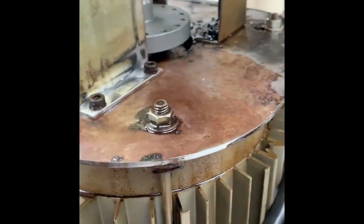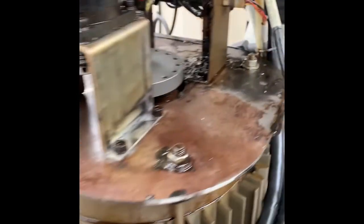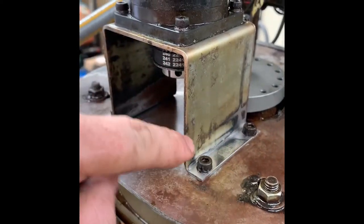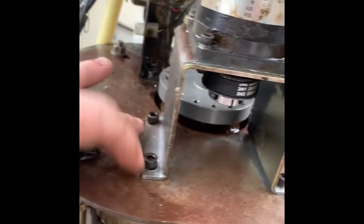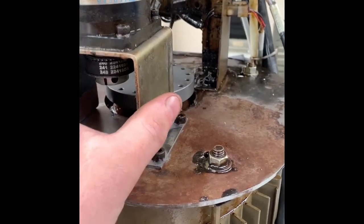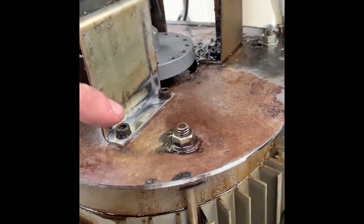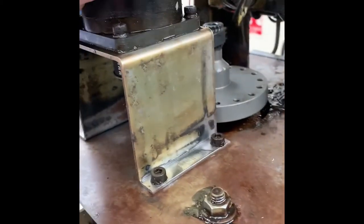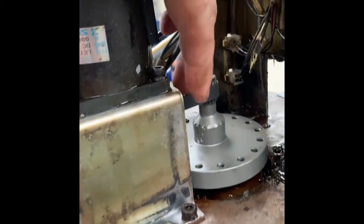Okay, so we've just taken this complete bracket off and cleaned it up, compressor, perfect timing. Clean this bracket right up. These four holes are only big enough for these four bolts. There's no adjustment like on a new machine where it's spring loaded to keep tension. So I took it off, crudely but knowingly elongated these four holes, and refitted everything. These were locked off so they couldn't move. Pulled the bracket back, so now you see the belt.